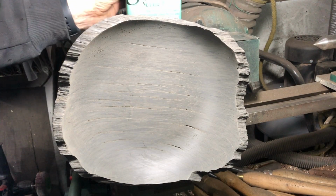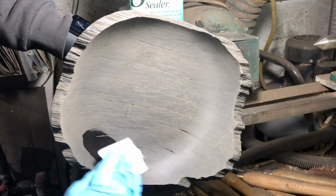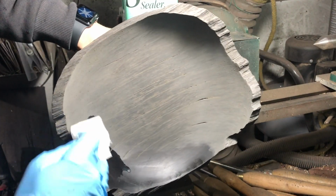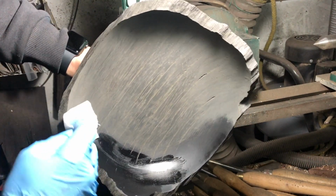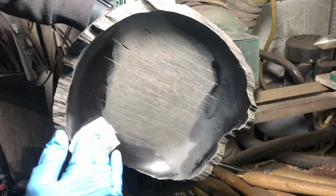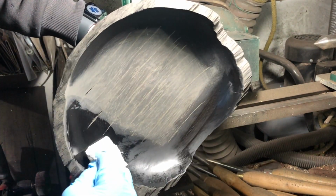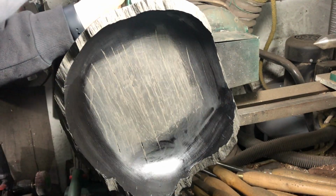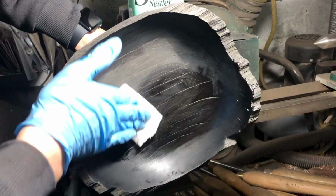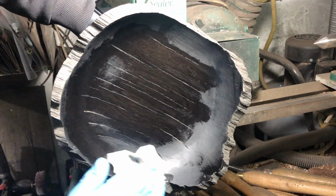Well, sanding the inside was a heck of a lot harder work than sanding the outside. Lots of 40 grit, 80 grit, 120, 180, 240, 320, 400. Sand sealer now. Really is a lovely black piece of bog oak. Such dark, dark colours. Very elegant piece sat inside somebody's home. I realise now grinding all the bark down and off like I did was a reasonably large waste of time. I didn't realise I'd be turning a thin edge bowl, but heck, it's turned out quite nice.